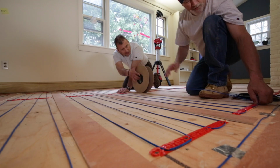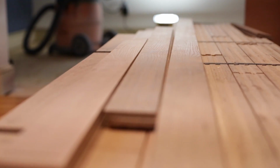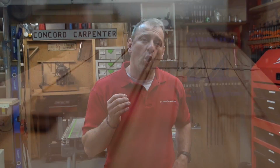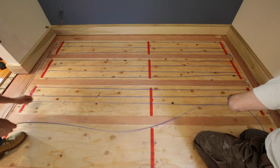There are some misconceptions about moisture in hardwood floors and radiant heat. Radiant heat, whether water-based or electric, does not affect wood floors. Only moisture can negatively impact wood flooring and cause it to contract and crack. Temperatures only have an impact at very high levels. And moisture, on the other hand, just a small amount of moisture can wreak havoc on floors.